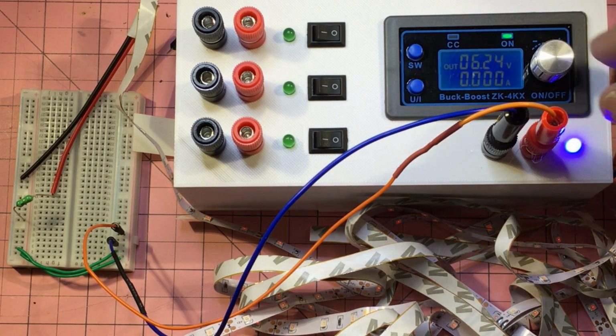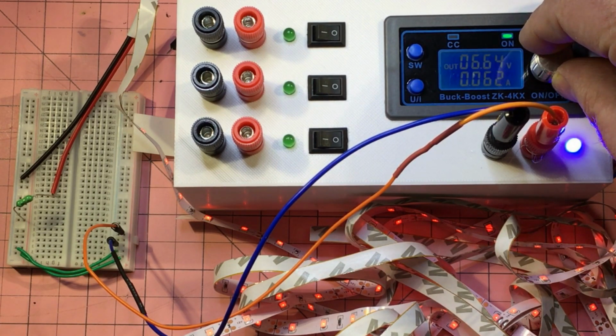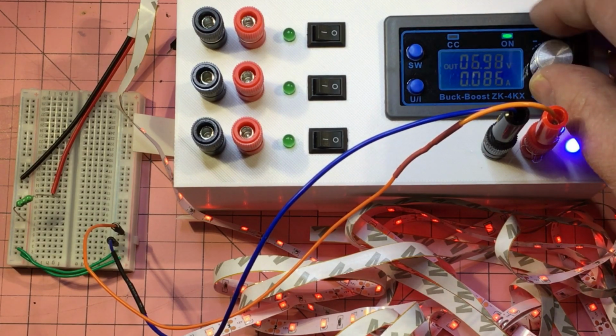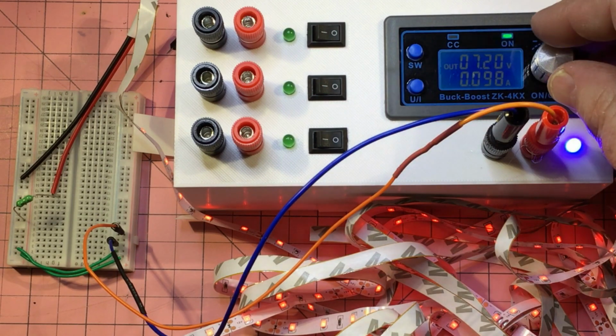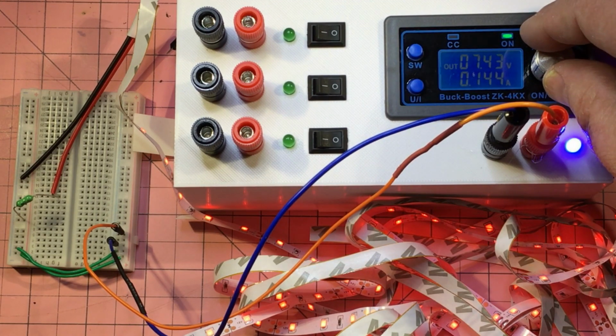So there we go. We can just see it flickering on now. So 40 odd milliamps, a little bit of action. 6.4 volts. No reaction from the fuse, still too low. Getting close to 100. Here we go. So that's 114 milliamps, 105, 100. It's dropping. 7.2 volts. Let's now just keep cranking, and we'll try and blow that fuse. Here we go, that's 140. Okay, so fuse is good.